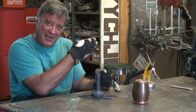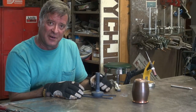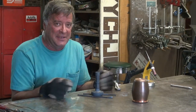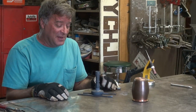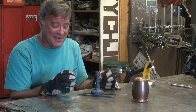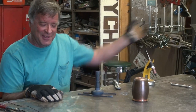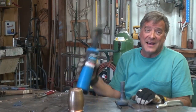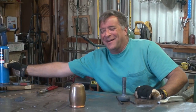You've got to have all that amperage, because when you're working with copper, it's a great heat sink — that's really its job, conducting electricity. It makes great frying pans and things like that. You've got to hit it hard, really step on it. I was running with a foot pedal just all the way to the floor, 255 amps, just trying to get it hot. I tried my little propane torch — it wouldn't even get it anywhere near up to temperature.